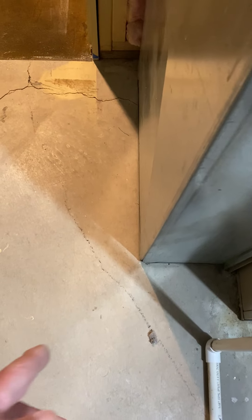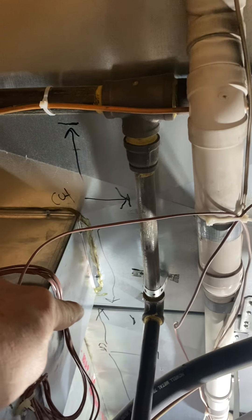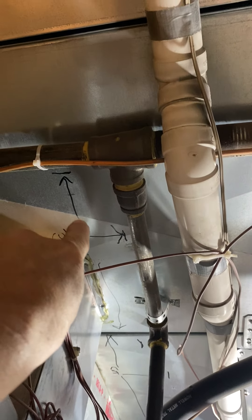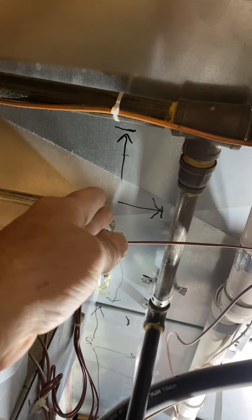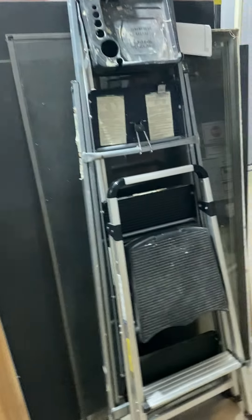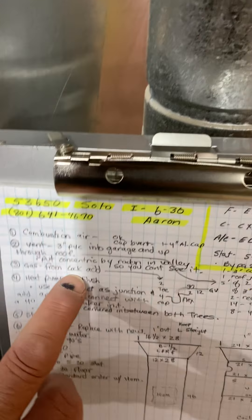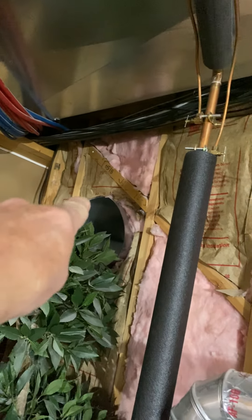Your boots can come all the way out to the very edge. Cut to that cut line then to the edge. That side is going to be straight, this side is going to be a 90 with no starting collar from front to back, because our duct is right there right in front of the gas line — I have it going back a half inch.